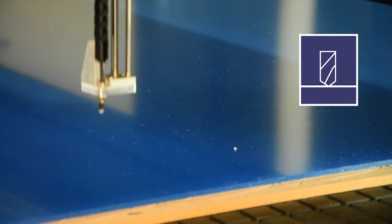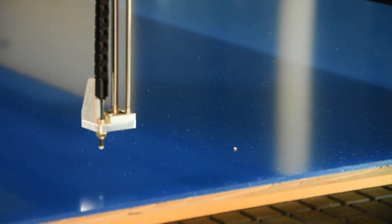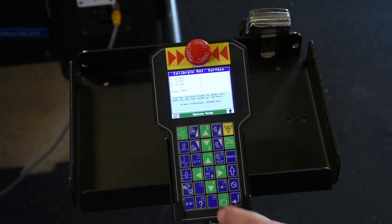Let's do it again for the top. Pressing the surface key, the probe fires down. Jog down to somewhere near the material top and press zero. Done. You can have your new hire operating your machine almost immediately and save your company's resources and maintain production efficiency.